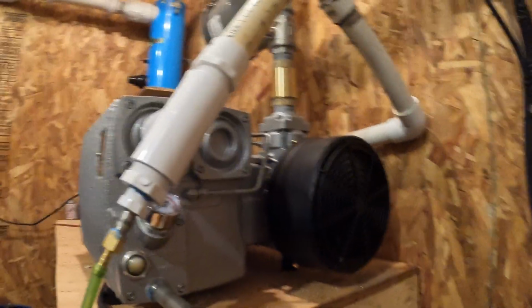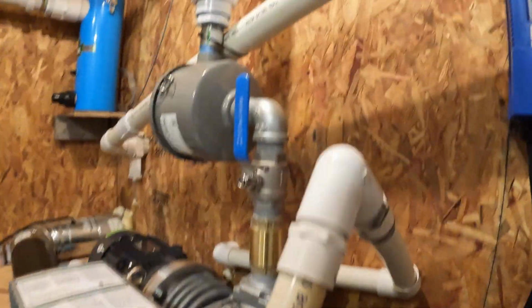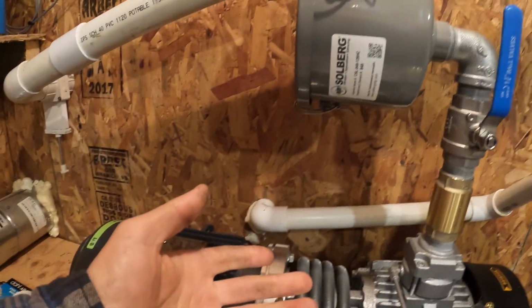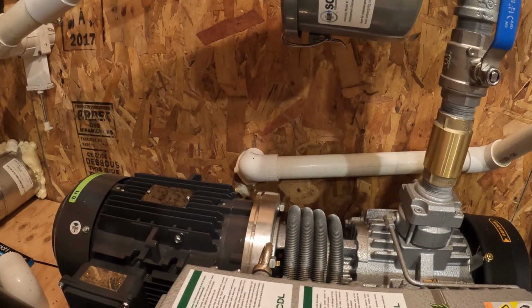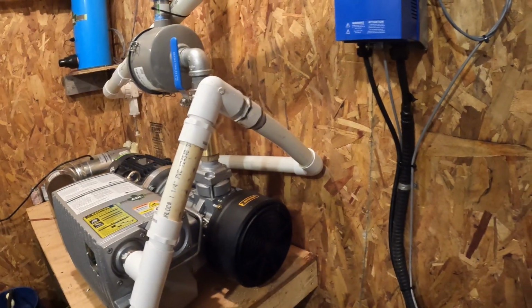These pumps produce a lot of heat and you want to take it outside the station to keep the temperature inside around 10 degrees for the conservation of the sap. So one way is to take the exhaust out because a lot of heat goes out from the exhaust.